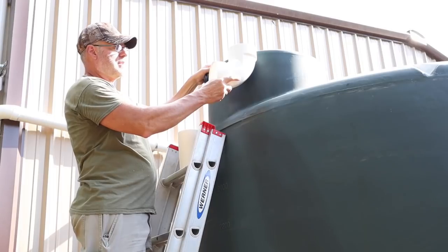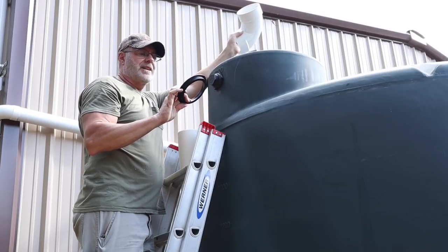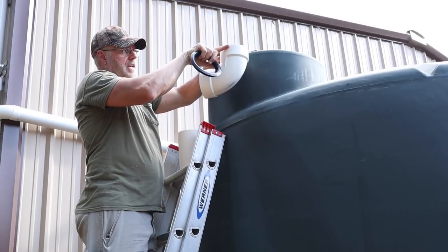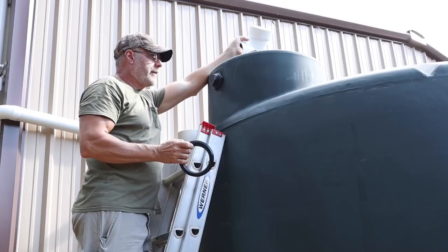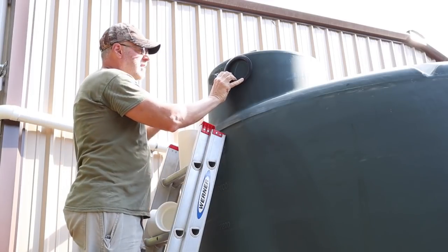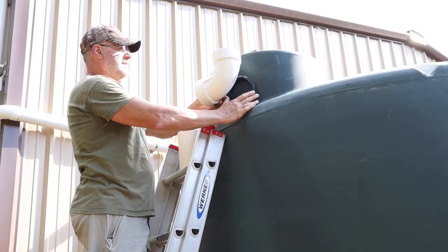Basically, I can put this way up near the top on the inside, which would put this Uniseal down here somewhere. The only thing I'm kind of worried about is eventually, I'm sure in time, this Uniseal will start to leak. The rubber will get dried up, and now you know how that goes, right? And then it'll start to leak. Even though the water's up to here, all the way up to here, this will be submerged underwater, the inside, and it might start leaking. So, and once you put a hole in this tank, you put a hole in it. So, should I put it all the way up near the top here and just have the water come out up to this level and then it'll come out? Or should I put it down here and take advantage of that full 3,000 gallon all the way up to the top?